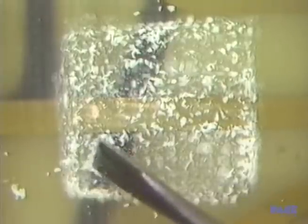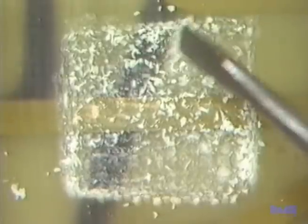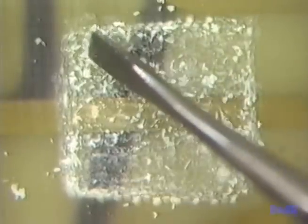We now want to square up the sides. For this, we use a chisel. We want to leave the corners slightly rounded for ease of epoxy replacement. Carefully chisel straight edges and a smooth base — this is critical for rebuilding the substrate to its original dimension.